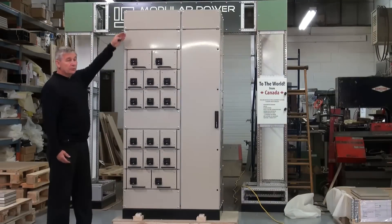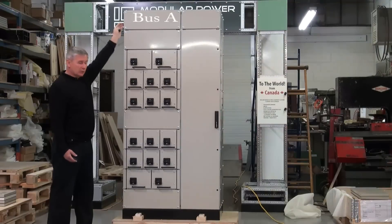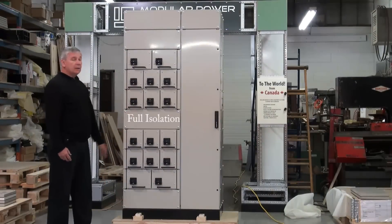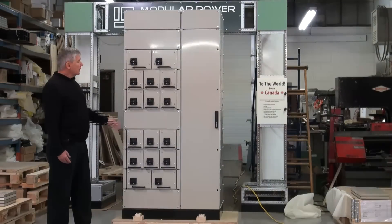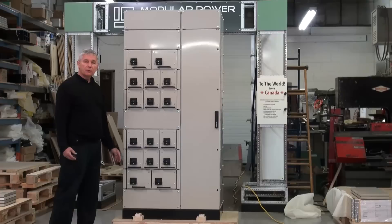With the flexibility of motor control center design, we have a 600 amp top horizontal bus and a 600 amp bottom horizontal bus with the space in between. Included are 16 starters: 12 at 25 kilowatt maximum for direct online and 25 kilowatt reversing starters. These are called mini-withdrawable units, MDU units, and fall under the discussion of a fully withdrawable unit.